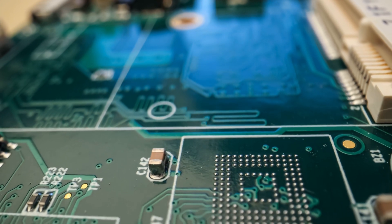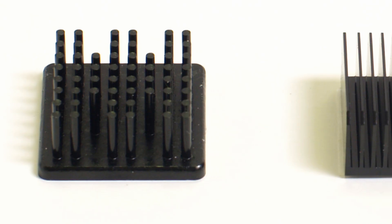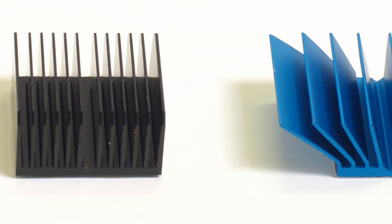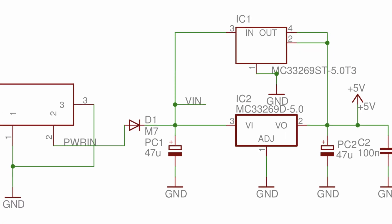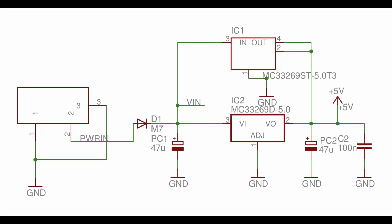I will leave a link in the description below that will take you to an interactive calculator on my website to help you out. This brings us to the first main limitation of linear voltage regulators, which is that they're not very energy efficient. Because of this, you will only reach for this type of regulator if you are dealing with low-power embedded circuits. But still, these components are used in many electronic devices, although they generally are accompanied by a large heat sink or the PCB has been designed to dissipate the heat. If you were to look at the schematic of the Arduino development board, you would see that it uses a linear voltage regulator for its power needs.